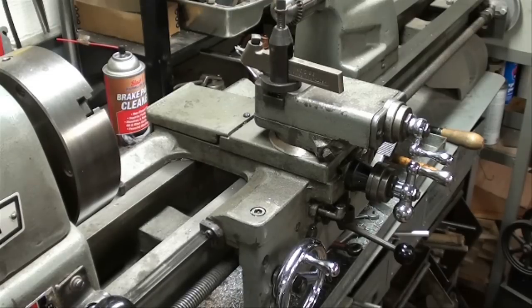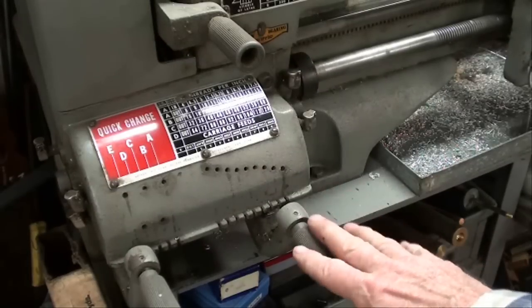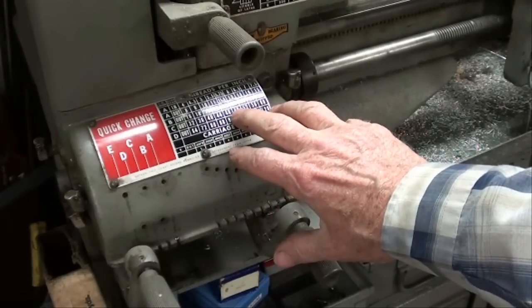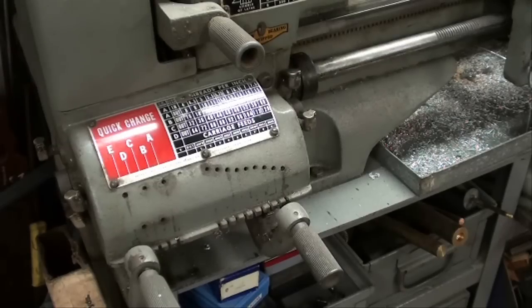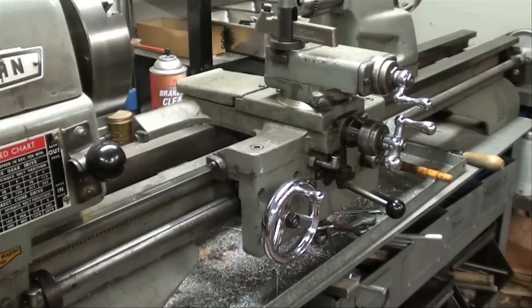So that's a little rundown on my power feed. I think now you know why I put the tumblers in the neutral position, so that we're not feeding power into the gearbox. The power is coming all the way here — you can see this shaft turning — but the gears are not engaged. I hope you enjoy this little video on my Rube Goldberg power feed. This is Tubal Cain signing out, saying so long for now.